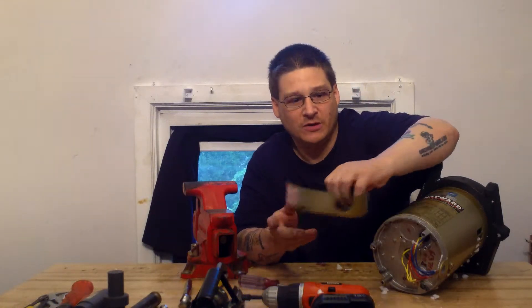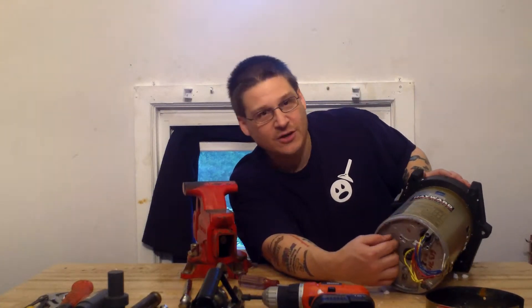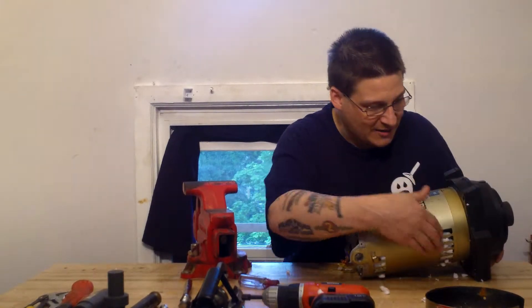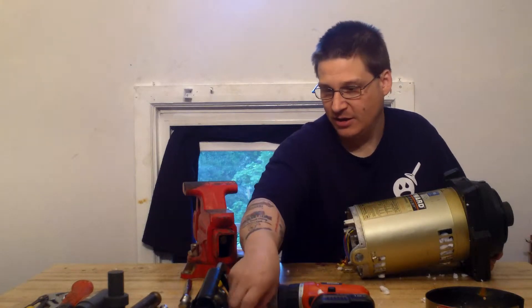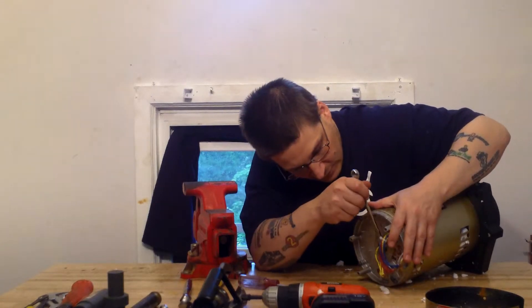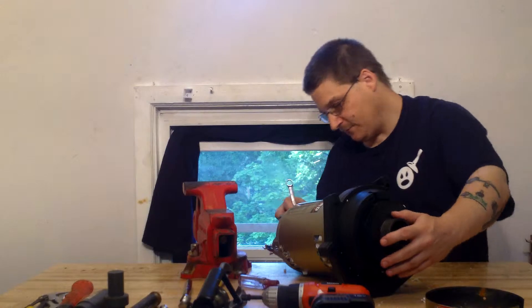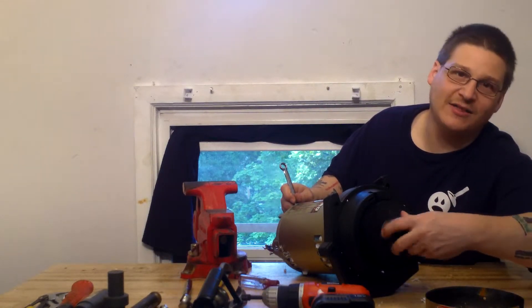It also makes a nice parts container. So once you remove that, you can see you have the shaft here and we have an impeller up front. There's a lot of packing material coming out here from what the customer sent it to us — we'll remove that in a second. You want to take a wrench and put it on the flat spot on the shaft right here. Put your wrench right there and then grab your impeller, put your wrench back here, and turn your impeller just like that.